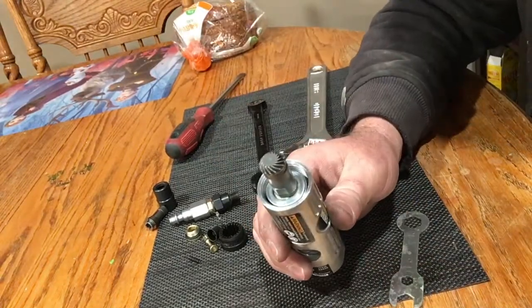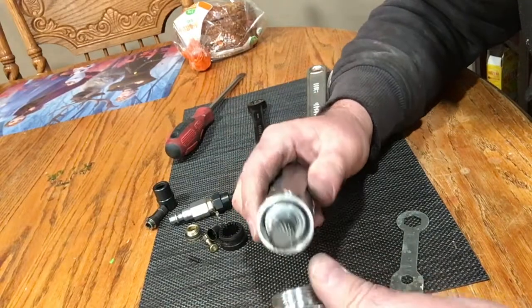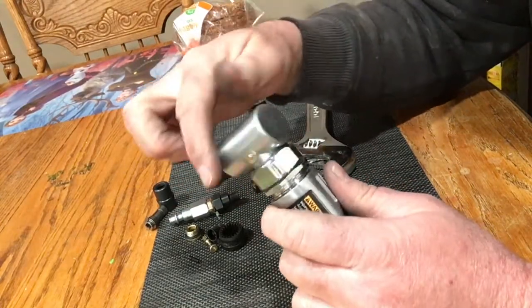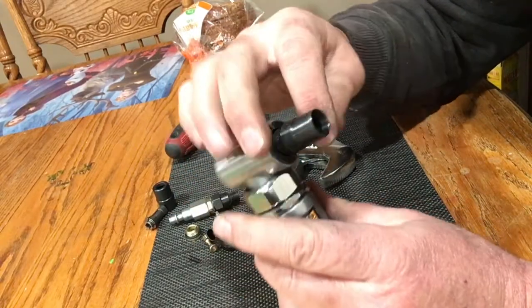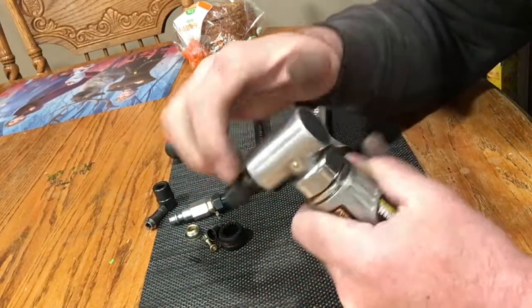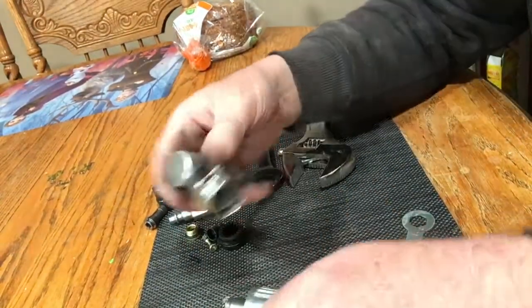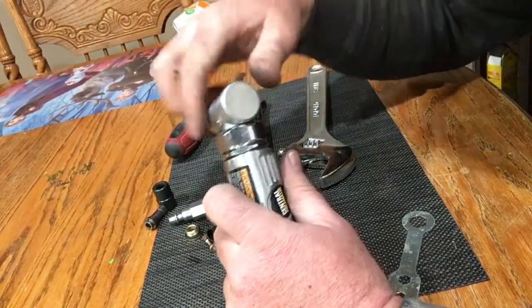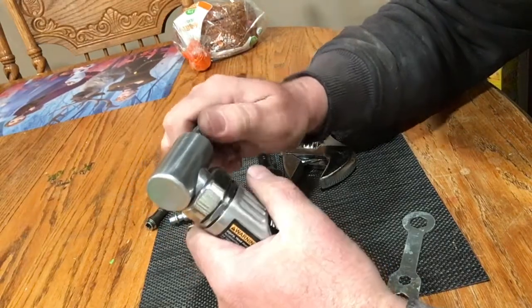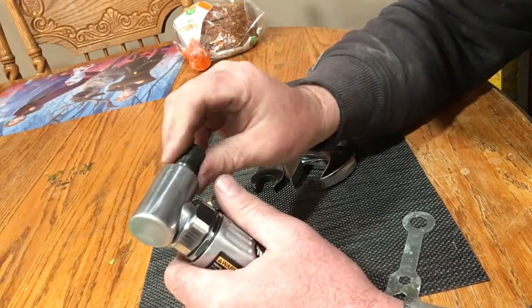Here's the crucial part. I'm going to dip this in grease and smear it all over it, but I'm not going to do it right now because I won't use this later. We should dip this in grease. When you put this back on here, make sure this head assembly is all in there. Now those gears have to meet and they can't be conflicted. This thing spins and put it on there — it's not really meeting up right now, so we're going to have to adjust a little bit. Push that in a little more and screw that on. When those two meet up it should spin pretty freely — and I think it is. So connect your air hose and it should spin freely. It does need grease.